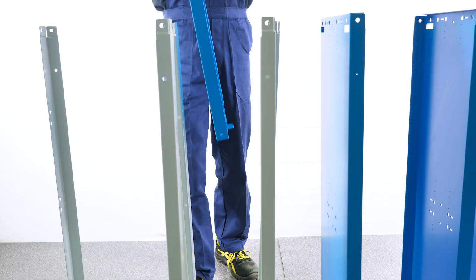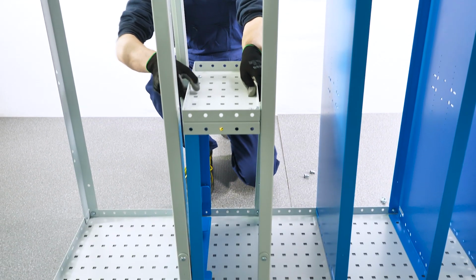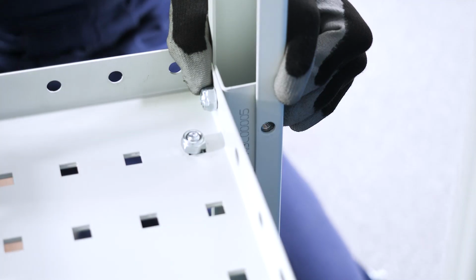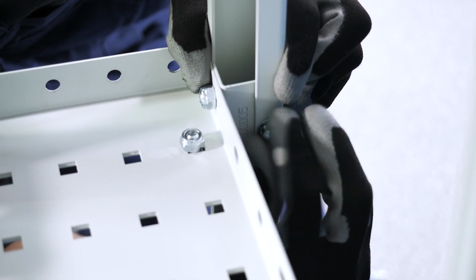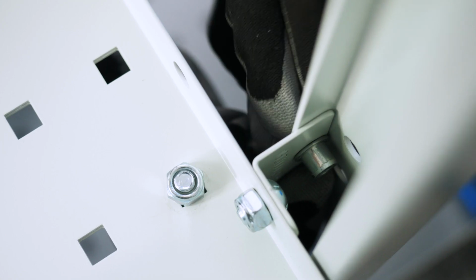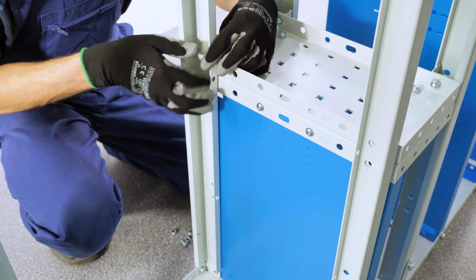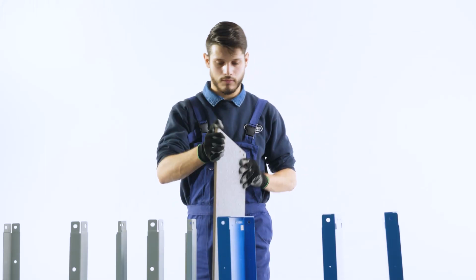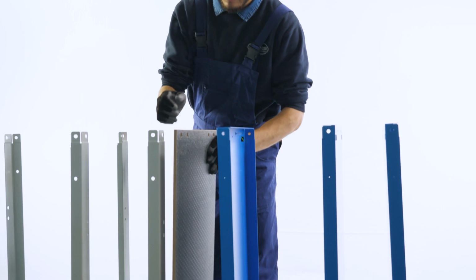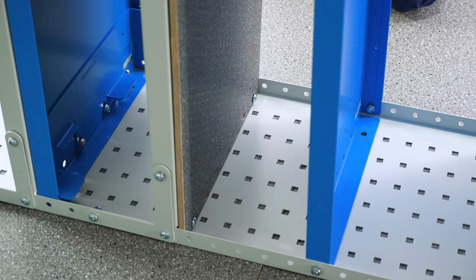The pre-assembled shelf can now be fitted to the racking structure and fixed at either side using reinforcement brackets whose threaded inserts align with the holes in the horizontal profiles. Finally, the shelf must be fixed to the horizontal profiles using 4 screws, 1 at each corner. Over the profiles, we now fit a marble-look plywood top, using screws to fix it in place.